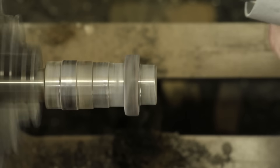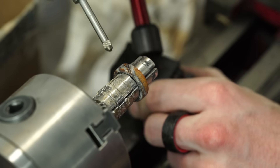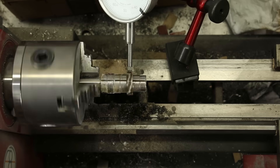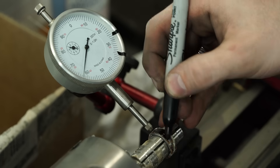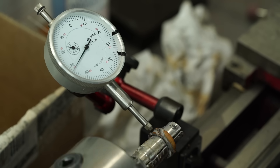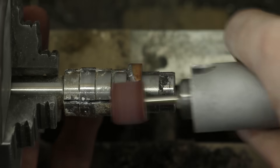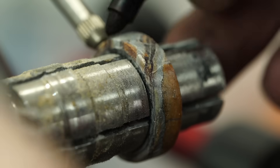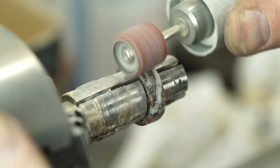I eventually got it down to a diameter that was pretty close. Now I need to bring out what's called a dial indicator. It's got a very precise needle at the end that measures how much in or out it is — the dial shows you how many thousandths of an inch something is off. When I rotate it, I can see all the high and low points in the diameter of the ring. I take a Sharpie and label all the high points, then sand them down with the Dremel, and repeat the process until I'm within about five thousandths of an inch — more than plenty for a natural-looking material like this.